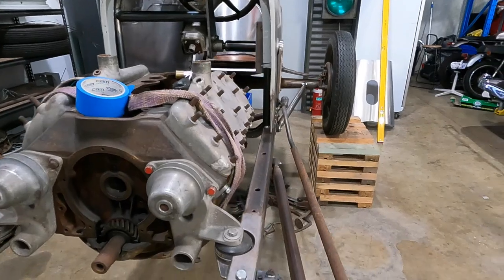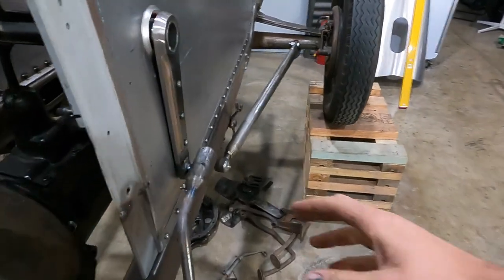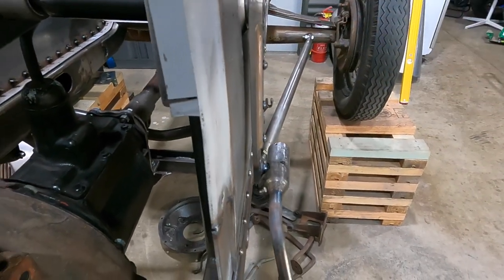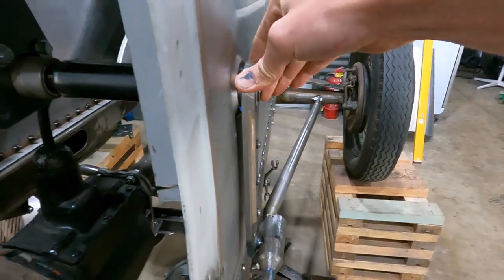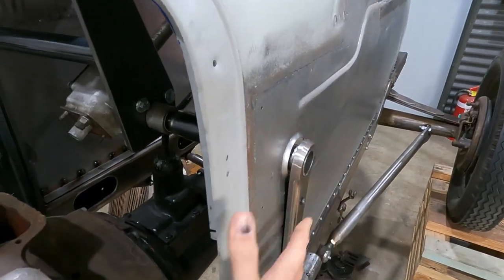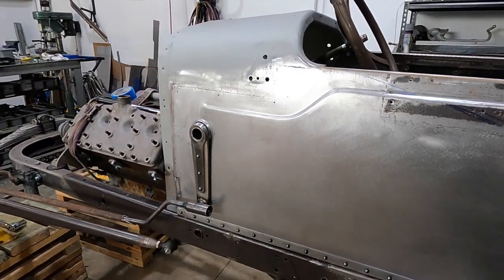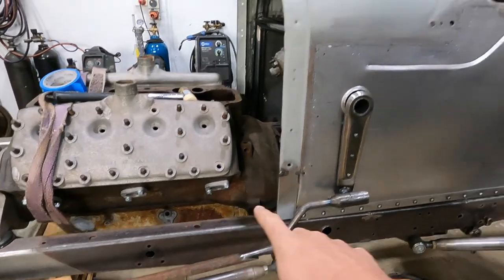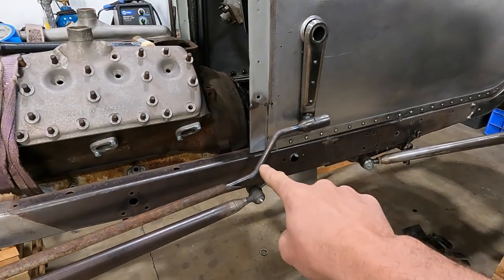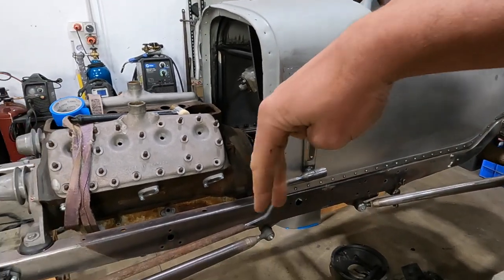So I've made it follows the wishbone in, and then I'll kind of dogleg this a little bit so that this is parallel with the body. That'll basically sit something like that, nice and tight to the body. So there's not a whole lot of interference when it comes to building the extractors. The step thing was kind of a coincidence. I don't know if you can see, that's the step in the body line. And this is actually the exact same, 45 degrees, 90 mil dropout, same as that. So it's just little steps all the way down.